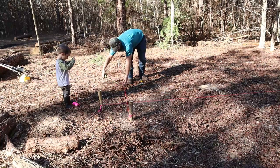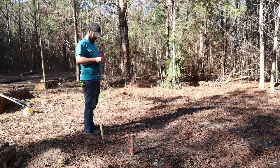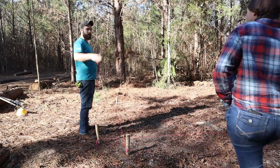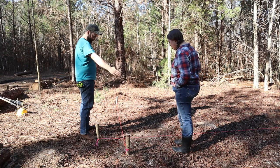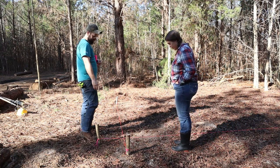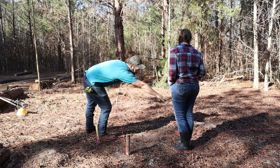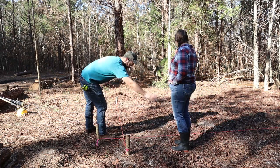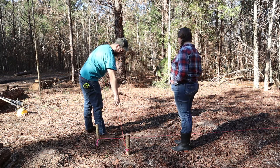Close enough. Hey. I'm just using what's called a 3-4-5 method. You sit here, you run one line, and to get it square, where it's a complete 90 degree, you measure off where it goes back. You can either do 3 inches or 4 inches, it doesn't matter which way. But I just did 4 this way since it was longer.